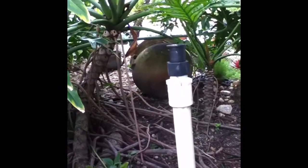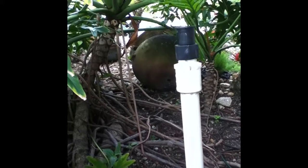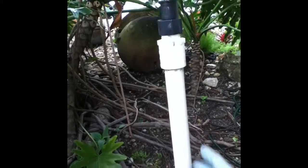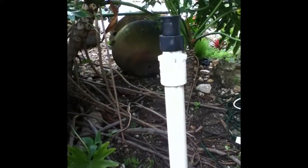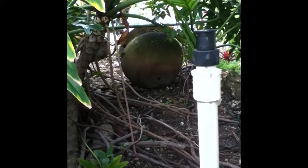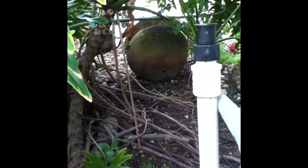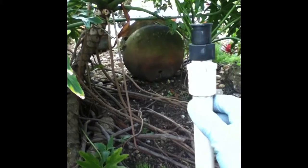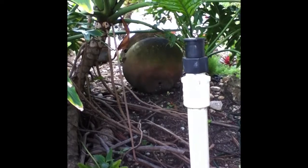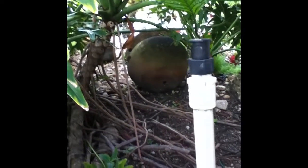Because the objective for this property is to replace every single spray nozzle with a rotary nozzle, even the instances where there are risers, they want to replace it with a rotary. So in this case, the goal is going to be to cut the riser at some point and then put the rotary head on an adapter, and it's going to fire off from here on top of the riser.